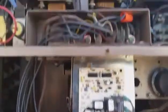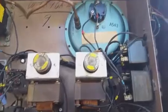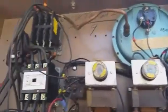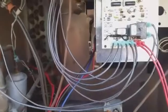I'm gonna leave it on 30 minutes to get the maximum out of defrost — probably the least efficient setting, but I want to make sure we set it for the lowest amount of time between defrosts. Because we've got a big coil over there and we only have one coil sensor on it, I want to make sure this thing is staying clear. But that's about all for this one guys — see you on the next one.